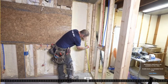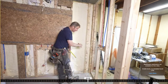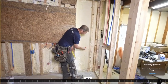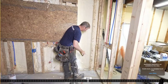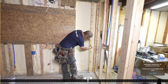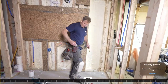That's going to be where our rough framing is going to be. Now I would recommend taking another 1/2 inch, because you could always build this up to get the tile to work right. But if your grout joint on your tile comes right here and you have this sliver, you're going to have to cut out your framing and lower everything. So if we're going to go 42½, we're going to make our total niche 40½ inches, which is going to be our rough end framing. We're going to have like 1½ inches of play.